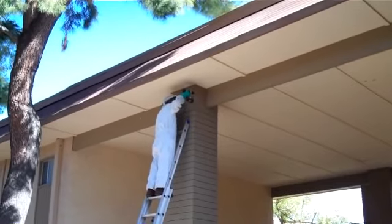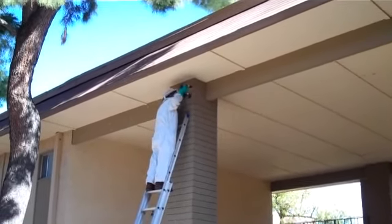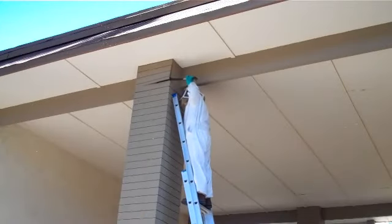The technician, finding some screws and access points, is going to undo the front of the top of the pillar. It does take a little work because caulking, painting, and the materials left behind also have to be undone, and it takes a little bit of prying to get off the front slat of the beam.